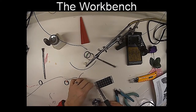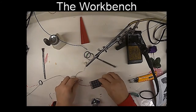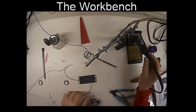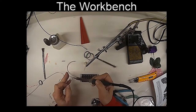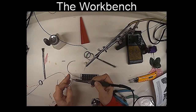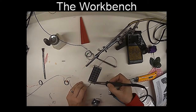This is a silicon solar cell. So photons, light particles from your light source, will come down to the silicon atoms on here, strike the atoms, add energy to those atoms, and kick the electrons off of the outer orbital of the silicon into free space, and those electrons can then conduct, move from the positive to the negative side, and that's all there is to silicon solar cells. There we go.